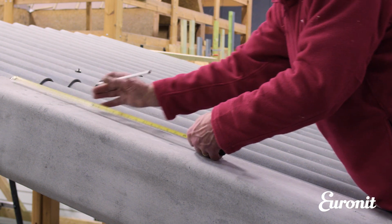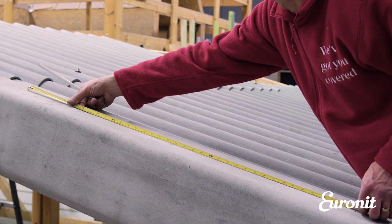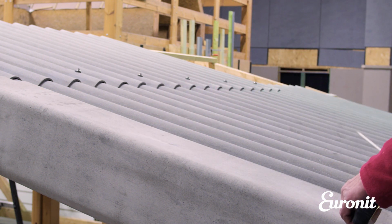The bargeboard should be fixed at all purlin positions using self-drilling screws as per the sheeting, with intermediary fixings between to ensure maximum 750mm centres, using self-sealing fasteners to stitch the fibre cement together.